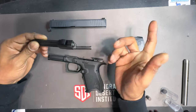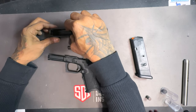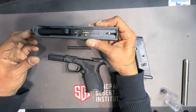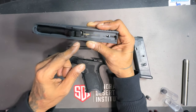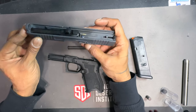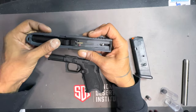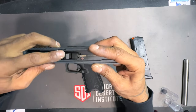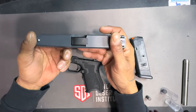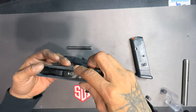This is the go gauge. I take the barrel, put the go gauge into the chamber — just let it slide in lightly with your finger, no pressure needed. Then put the barrel into the slide and lightly press the barrel towards the breech face, making sure the rim of the go gauge goes under the extractor to get a clear reading. As you can see, it is locked, it is fully closed. From the top you can clearly see that it is fully locked with the go gauge.